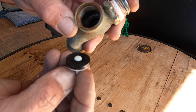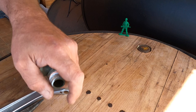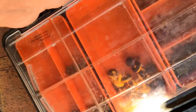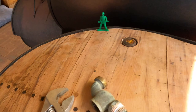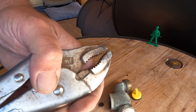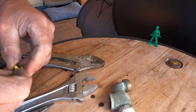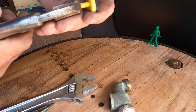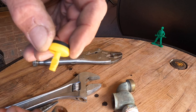I can just use an old trick that I've done for a while - we're jamming that washer. Just a standard tap washer. A pair of locking pliers. I'm just going to pinch that tap valve about halfway. Now the jumper washer can't move anymore.